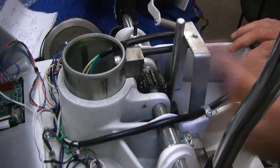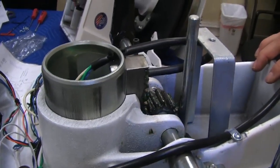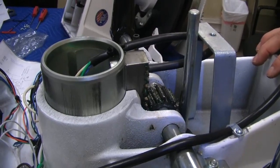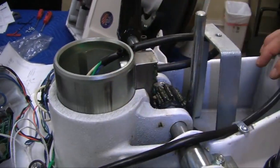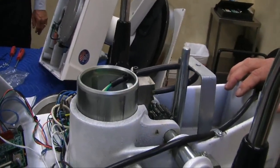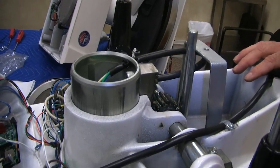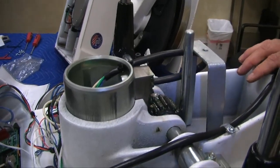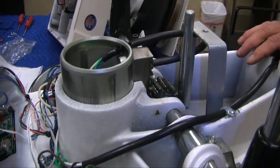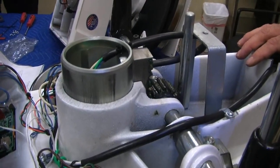And again, we have what we call 400 degree F temperature grease. This gets hot, but if you put in grease that flows at a lesser temperature, let's say on this piece of machine, it's not really a big thing being 150, but our tortilla press, etc., if you put grease not up to the temperature, it'll start running like water and it'll be all over the place.